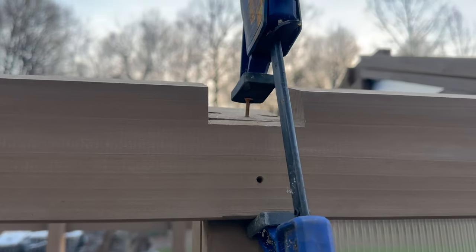After the roof panels went in, the next step was to put the corbels on — their tops are at 31 inches for the back wall. Then the two boards for the back shelf go in, with two screws on each end and one screw each in the center supports. The top shelf is now in place — pretty straightforward — four screws on each end and one in the middle on the centers.